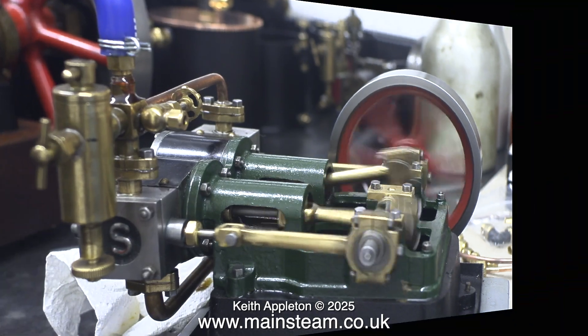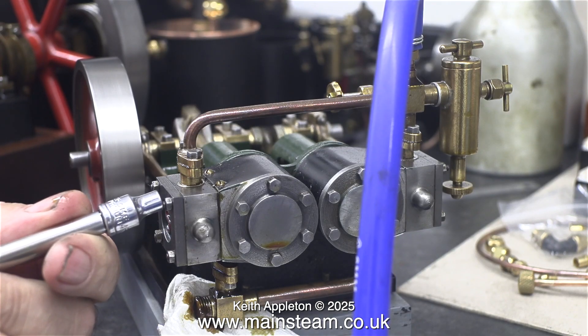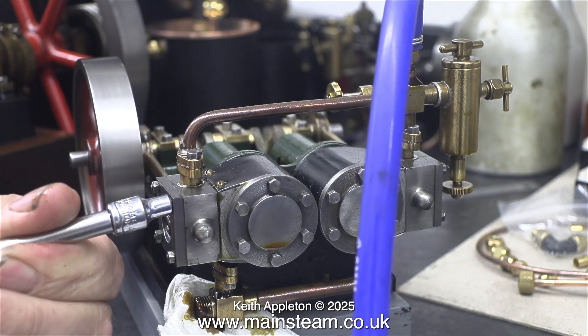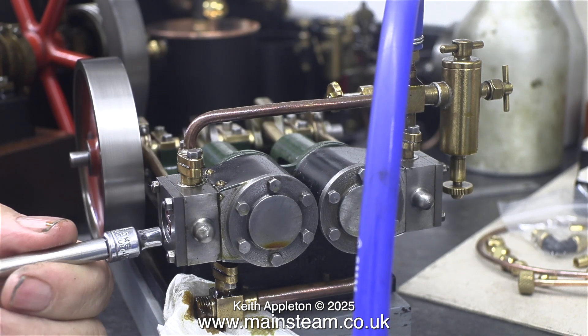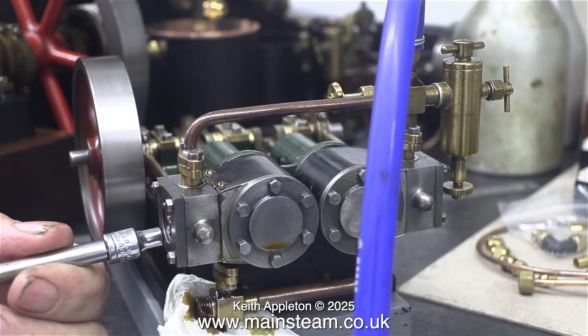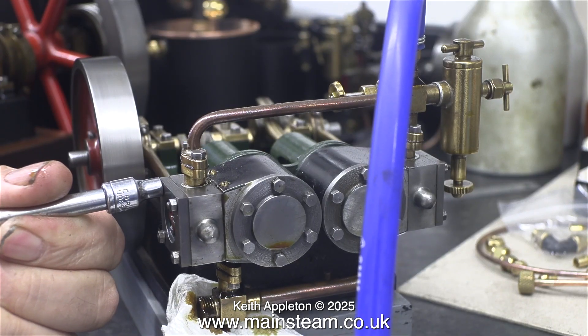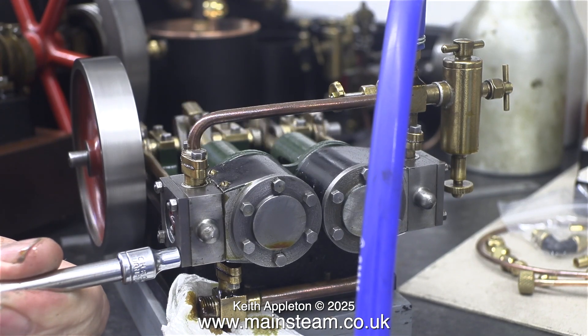After fitting some very expensive gaskets bought from Stuart Models — which, believe it or not, were three pounds each, and that probably didn't include postage or VAT — I fitted the gaskets and now there are gaps between the slide valves and the ports, which is the way it's meant to be. The only thing that should hold a slide valve to the ports is the steam pressure. Originally this engine was put together wrong: it was upside down, the exhaust port was at the top, and because the slide valves were tightly pressed against the port faces it did actually run by feeding compressed air into the exhaust port, which was no good at all.